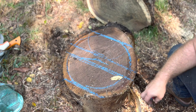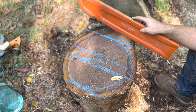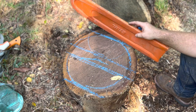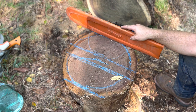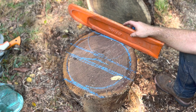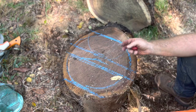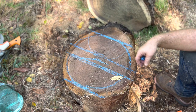This is where I see a lot of people making harder work. You'll see people cutting directly into the end grain with their saw. You can do it, but cutting into end grain is very hard — it's hard on the saw, hard on your body, and it takes forever. So you're much better off flipping it onto its side. It's called noodling: you're cutting along with the grain and you pull out big strands of grain.